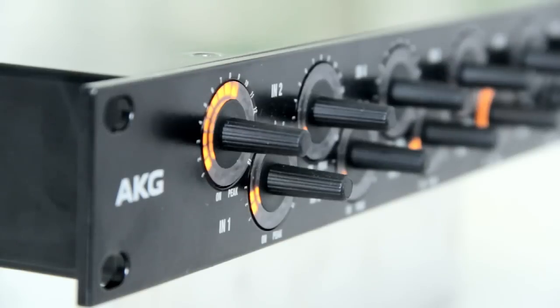Every unit adds its input channels to the master buses, which are transferred via an Ethernet interface. Every unit can monitor and output their master buses. The Automix algorithm also transfers the control data via that interface. This allows the Automix algorithm to function system-wide.